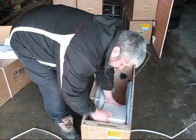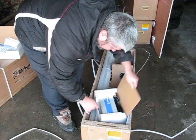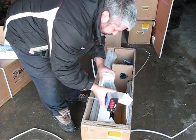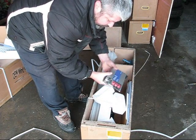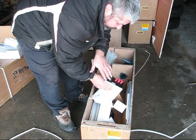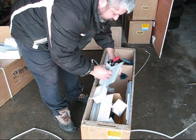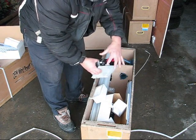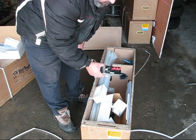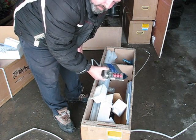I'm hoping this is a grid tie inverter — and it is. This grid tie inverter also has a dump load, very similar to the one we reviewed on our website a couple months ago. But this one has a dump load and also has some microprocessor control inside, which, after a power fault, will check every few minutes to see if the situation has improved and can turn itself back on.